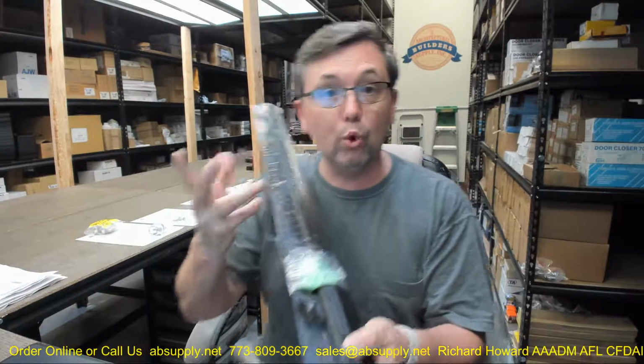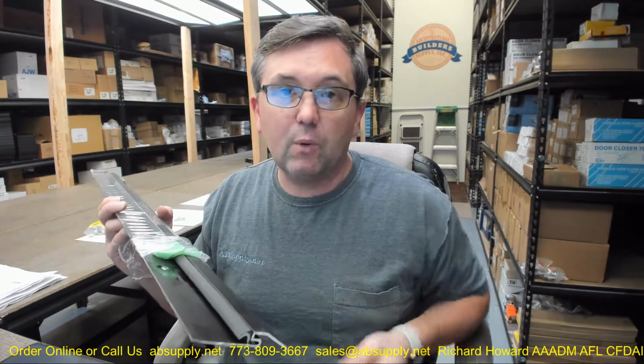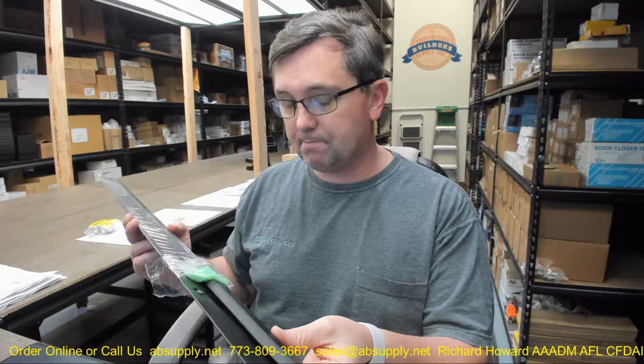And they're probably going to be a number 12 by, or a 10 by inch and a half, something in that range with this threshold. It's just a flathead wood screw with a Phillips drive, about 10 by inch and a half. You'll probably need other anchors, so be mindful that they'll get you started with screws. But if you wanted, let's say, machine screws and lead anchors, you'll have to reach out to us so that we can build in order to incorporate those specialty anchors, which I think I would never dream of putting a threshold in with plastic anchors. A lot of people do. Which is going to fail over time, in my opinion.